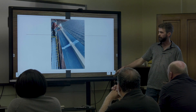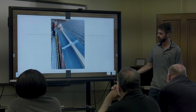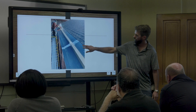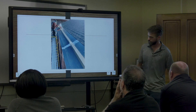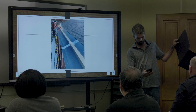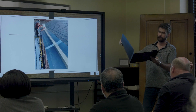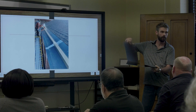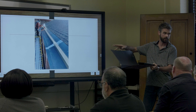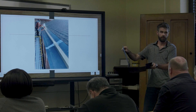This is the water table I was talking about — the Yankee gutter. This was over in Newport, an old church being converted into an event center. This right here is a separate piece of metal. On this lock strip on the front, we hook it onto a piece of drip edge and we don't nail the back of it — we cut little tabs, put a tab on, and fold it down. That allows movement in the back of these pieces on a long stretch.